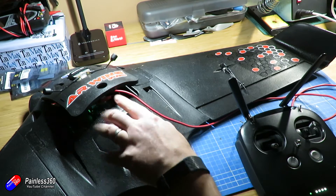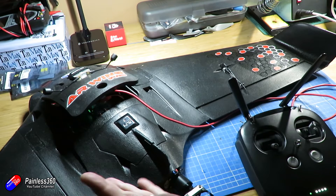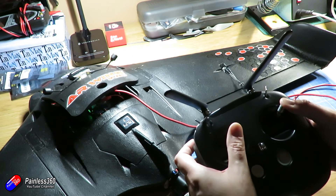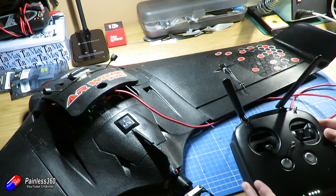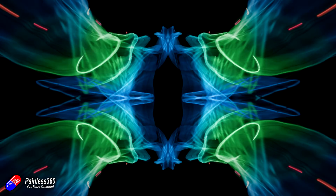So those are the four things: first, make sure that when you lift the nose of the model, INAV lifts as well — make sure your board alignment is correct, and always mount your flight controller the right way around in the first place. Second, make sure the radio channel values for aileron, elevator, rudder, and throttle go to maximum when sticks are in the top right corner. Third, in manual mode check that the directions are right and reverse any reversed servo in INAV. Finally, if you flick into a stabilized mode and the correction is the wrong way around, you've probably swapped servo outputs three and four. Hopefully that helps those of you who have been struggling with this.